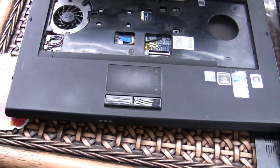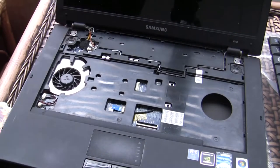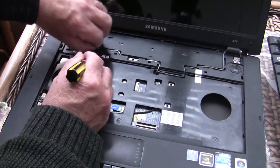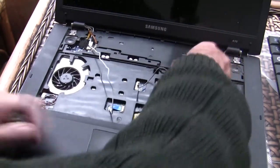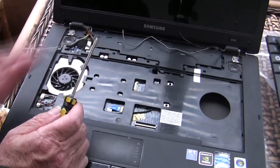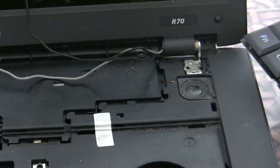We should also start removing this part of the computer. We're going to remove the screen — but first we need to unplug the screen. So we've got white, black, and grey wires that need to be removed. They run down a channel. White wire up, black wire out — a bit tricky but there we go. Next we've got two plug-ins from the screen to remove. Then we need to remove the hinges from the screen — there are two screws, one screw on each hinge. Remove the chrome-coloured hinge screws on both sides.